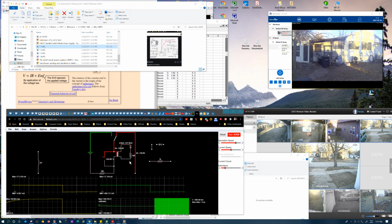But that's what I was trying to say, because we know when it's 1-to-1, it behaves just as it did with no transformer at all, just an inductor. But if we take the fact that this is charged up to a certain energy level, then this is disconnected, it's got that same energy level. So if you work the equation E equals 1/2 LI squared backwards to solve for the current, the current comes out to be half an amp, like you would think.